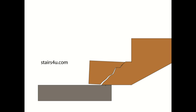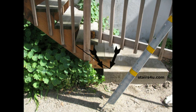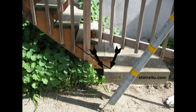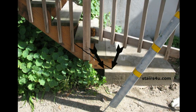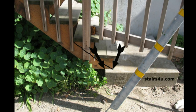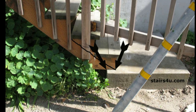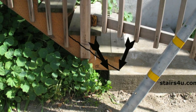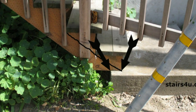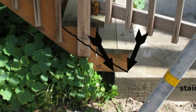This probably wouldn't allow it to fall all the way to the ground. Keep in mind that if the platform is like the one we're looking at, it's only going to fall about six or seven inches. But if this was a landing eight feet up — or even three feet in the air — you're going to have a problem if the stairway breaks. I've seen this on landings twelve feet in the air. I'm not making a mountain out of a molehill — this could be a bigger problem than you'd ever imagine.